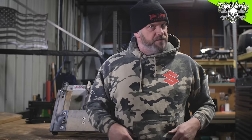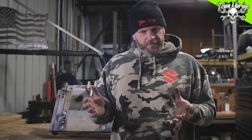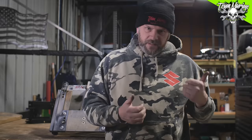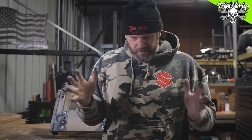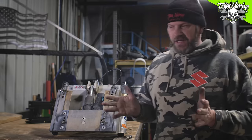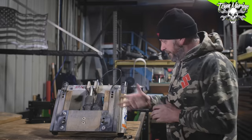I'm sorry I didn't have a BOBs plate here — we just did that service work. But on a BOBs, when you go to trim it up and it goes clunk and starts to walk its way up, you've got issues — that plate's probably not square anymore. Take it to your service shop, take the motor off, slide it out, clean everything up, make sure the jack plate is square on the transom, there are no egged-out holes. Safety first — and a leash isn't going to hurt you, putting one on.